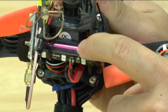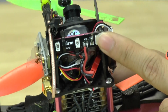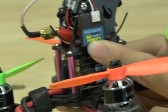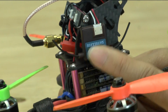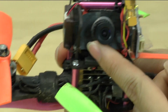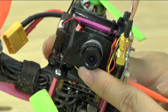In the back on this spacer, right in between, I actually stuck a red LED bar back here just to give me some reference when I fly line of sight — it's been really useful. I always like to have at least one LED on my quad. I'm using a Spektrum satellite receiver put over here — no issues with it, it's been really durable with good signal strength. The camera is the 1177 M — it's the uncased version of the 1177, the popular camera that everybody uses. It just doesn't have a case, which makes it a little bit smaller and easier to put into a frame of this size.